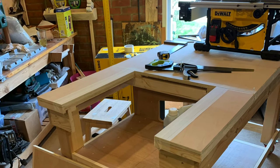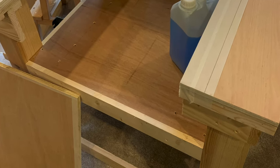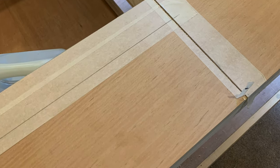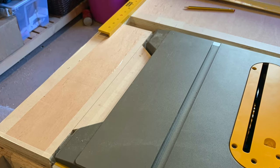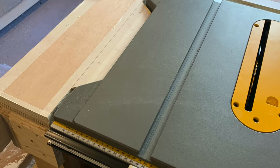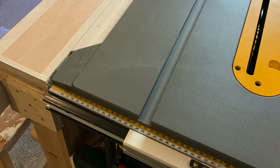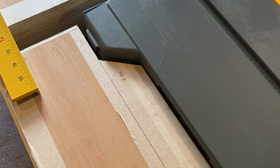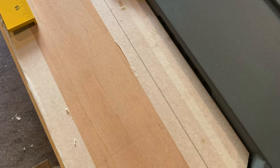You will notice in the picture in a second I've had to cut right the way across on the right hand side — that allows for the rack and pinion mechanism on the saw. Once I'd cut out the hole at the narrowest point of the table top, I was then able to drop the table into the hole and the outer wings acted as a template. I drew round those with a pencil, removed the saw, and then cut out the shape using a coping saw.